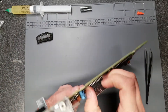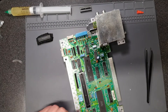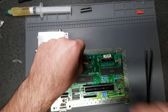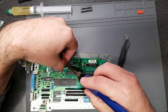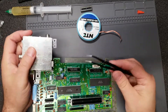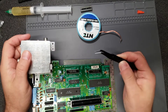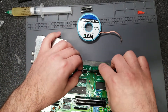You can see one half of the chip moves but the other half does not — there's some solder that looks like it leaked through to the other side. I'll try using some solder wick to help. Fortunately with the NES, if you do rip a trace on one of these smaller chips, the NES was designed to accept a larger-size chip as well — you can see the extra row of pads; they're all connected, so you could always bodge it that way.